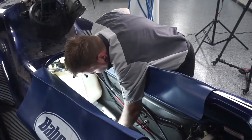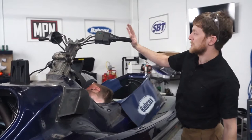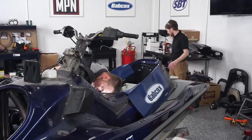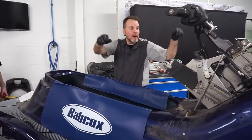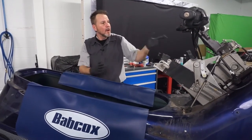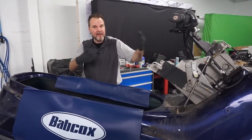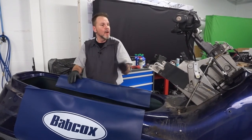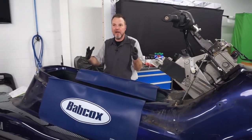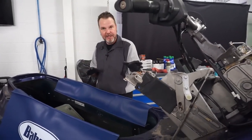Joe's locking the cable down in its ties. We can find approximately our straight ahead position, and our steering's off just a touch. So we've got our steering adjusted — we did a little adjustment underneath, and they also have you measure the angle. Going back and forth, you measure the angle down there until you get the exact sweep distance required. We made that correction down there. Any fine, minute adjustments might have to be done once you get it out in the water, but right now it looks really good — we seem to have equal distance on the steering.